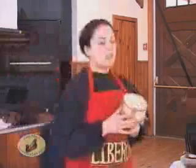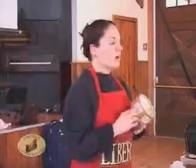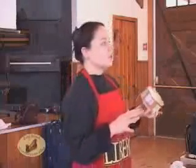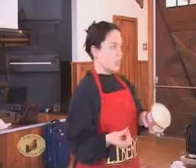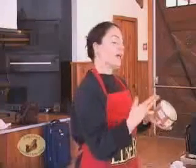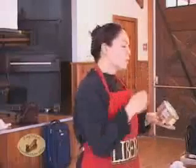If you have a raw piece or a stained piece, you could put it on stained wood. This wax is a paraffin base with microcrystalline and a little bit of carnauba — very little carnauba. In general, most people think the more carnauba the better, but the more carnauba, the harder it is. A piece of furniture may not need that much carnauba. Carnauba is what you put on your cars — it's the hardest wax available through nature and it's the most water-resistant.